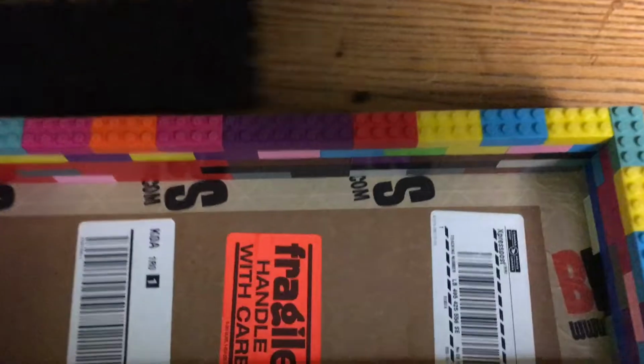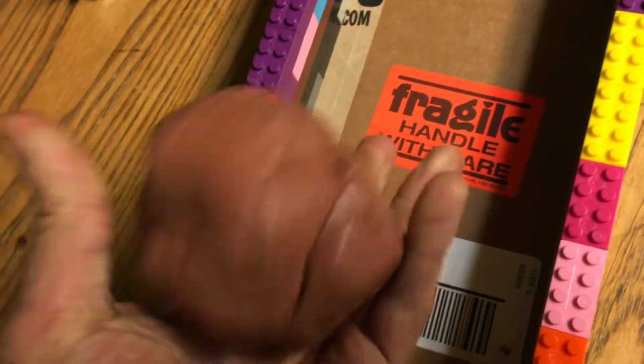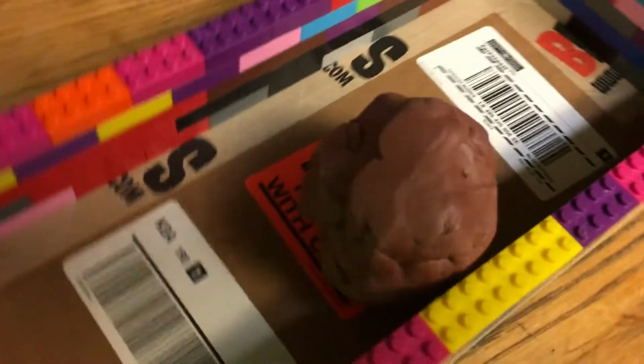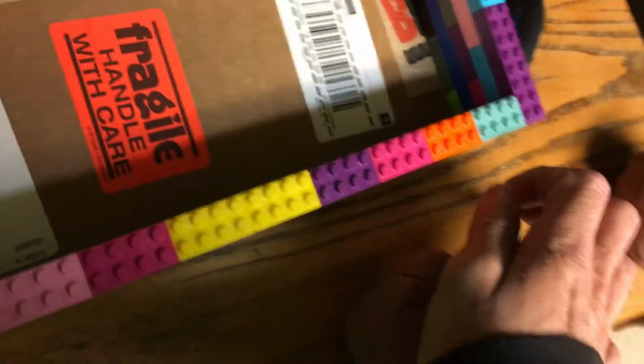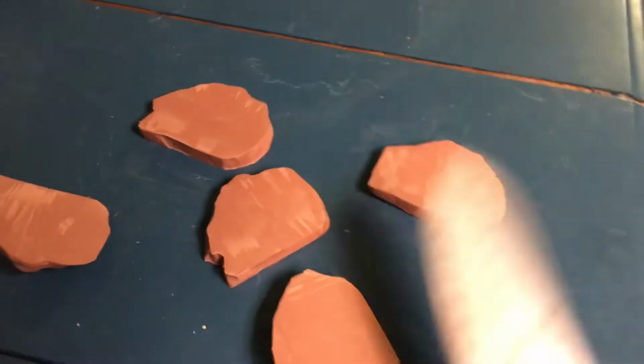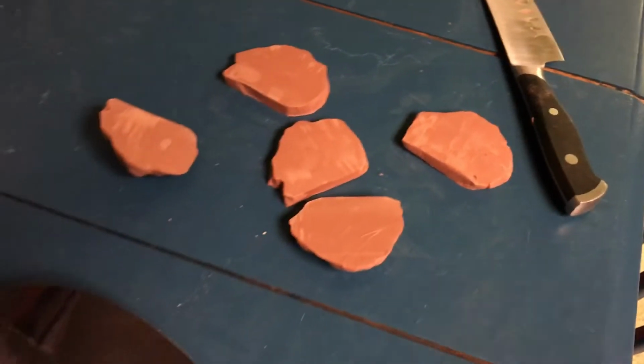And then once we got our clay, we'll refine all the little holes. Fill that up with clay. Smooth it down. Alright, I'll go get that clay. I'll do my bottom. Here's my clay. Now I just gotta work that on the bottom. Put a 1/4 inch. That's gonna take some time. So that's next. Yeah, that's pretty stiff. Decided to cut it with a knife. Nice and flat. I'll refine the edges. Speed the process a bit.